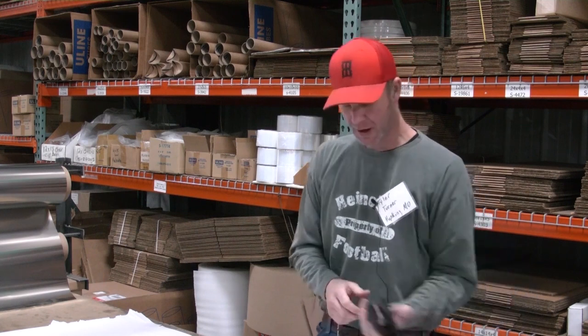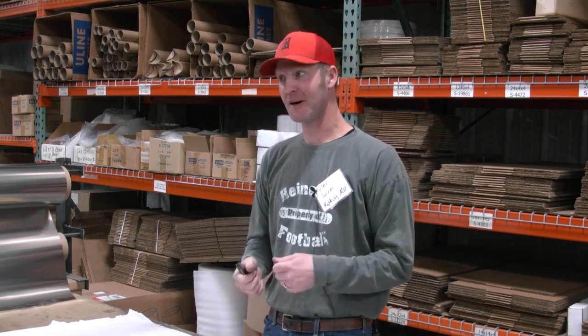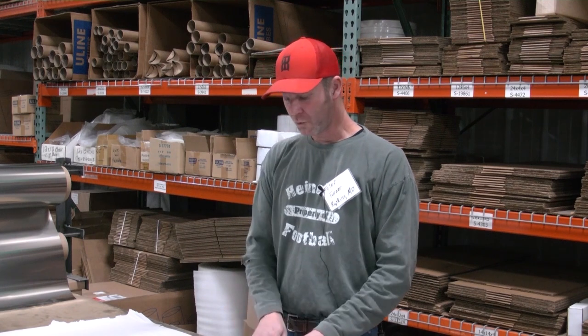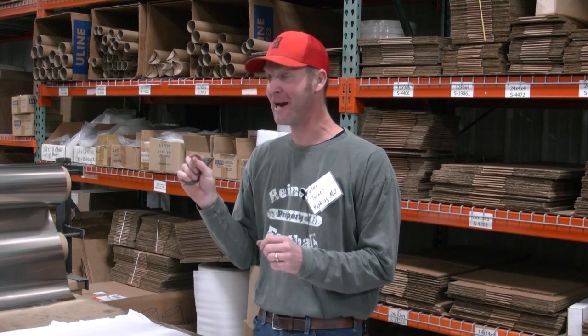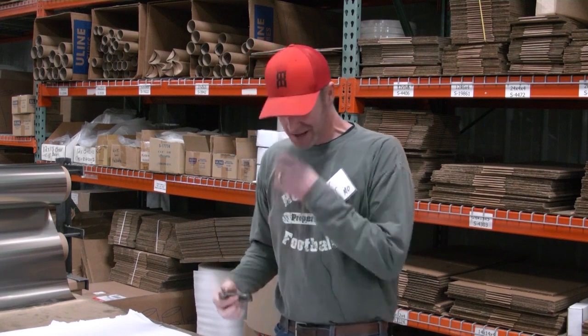So go back to your grinder, and you're gonna do this a lot because you're gonna be scared. It's a tedious thing. And then I switch out my belts at that point to like a 400 to a 600, because with that 120, boy, you'll be at 2 to 5% lockup, which is nothing, then all of a sudden you're at 80, and then you're making stop pins, and you're having a bad day.